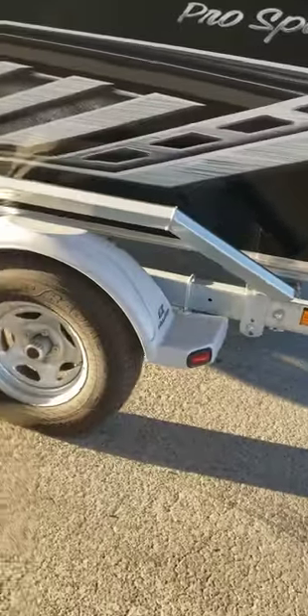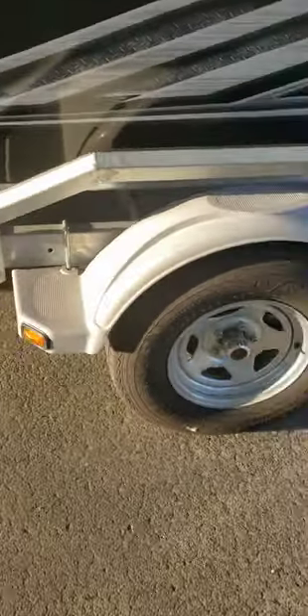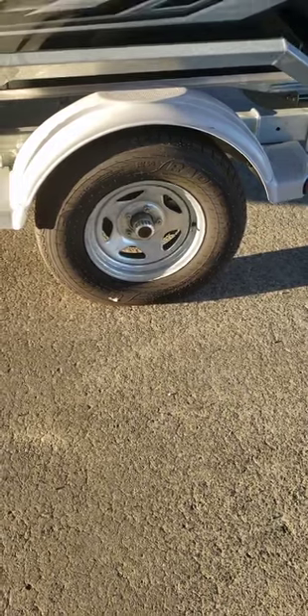13 by 19 aluminum right-hand prop. There's your screen for your live well, drain plug, step, tie-downs. I seen one little mark in the back. You got chine guides — so you don't rub on your paint, those are the good ones. Gear bath oil: brown is good, white is bad. Disc brakes, 5-lug.